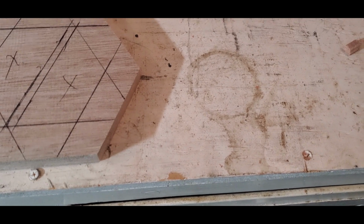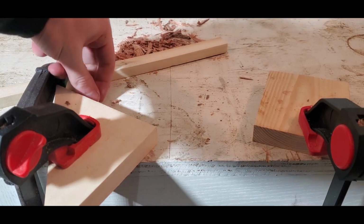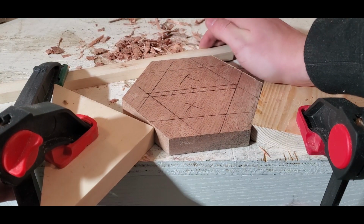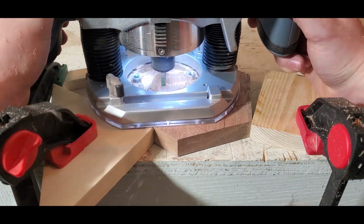After a great breakfast, I decided that I wanted to make the next trays mirrored of one another so that they could close and form a case. I did this by making the same 1-inch lip and then adding a center line to each of those so that the case could have two sides. I again used my router to remove the portions I did not need and would be cleaning up the edges with my chisel.